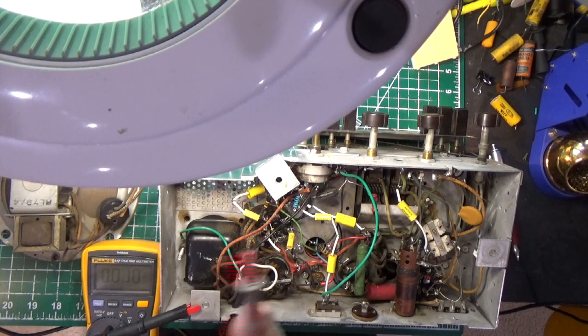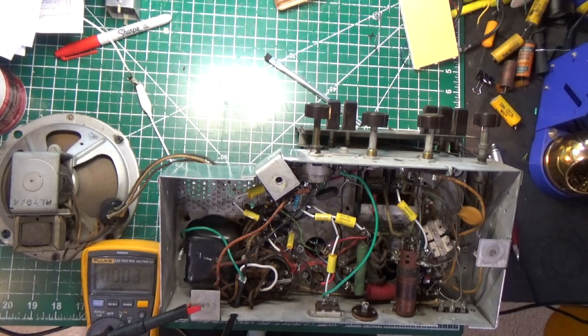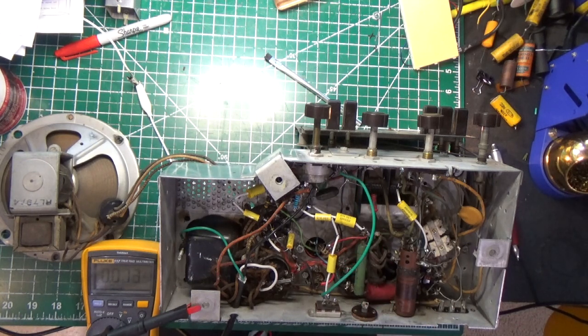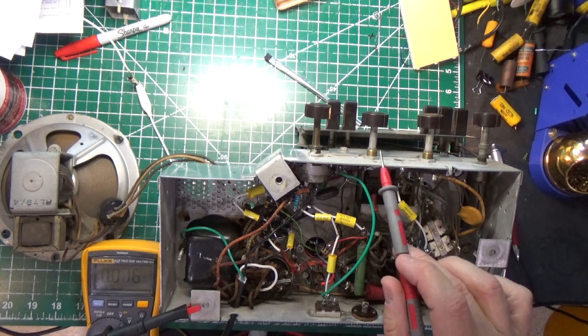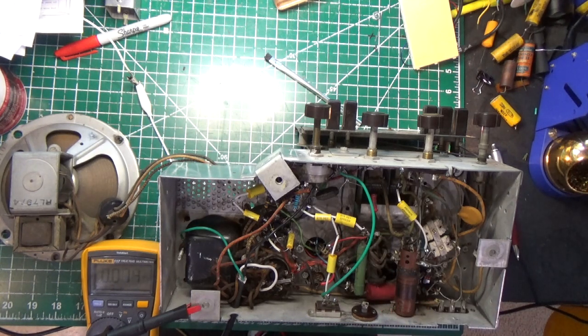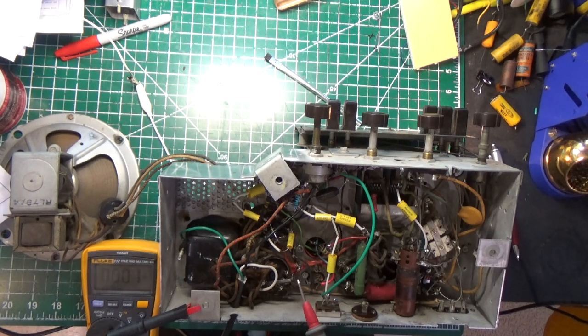I showed you on the schematic where the differentiation is between the audio and the RF. The next episode we'll be doing that. I still see some resistors in here we're going to have to change — like this old dog bone — but I'm purposely not doing it yet because I want to prove why it needs to be changed. Also, on this tone control there's a ceramic disc cap here — 0.47 again — and I don't think that's the correct value for the tone control. I want to go through that, identify it correctly, and replace it with the proper value. It goes from the tone control over to the 6SQ7 pin 4.